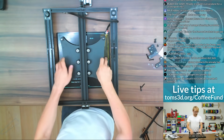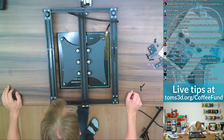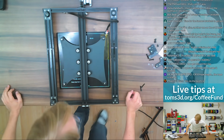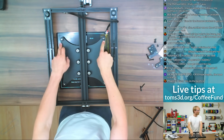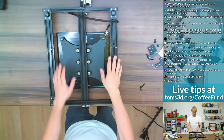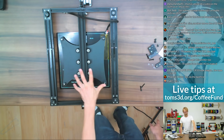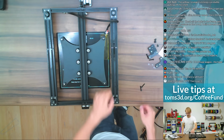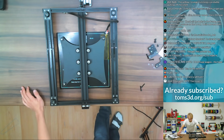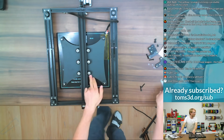So as you can see, this is a large aluminum PCB heater. It's got some interesting tracks, and we do get a 4-point leveling system right here, so 4 points to adjust the bed, which is over constrained. But then again, this thing isn't going to be perfectly flat by itself, so I guess you need all 4 points.